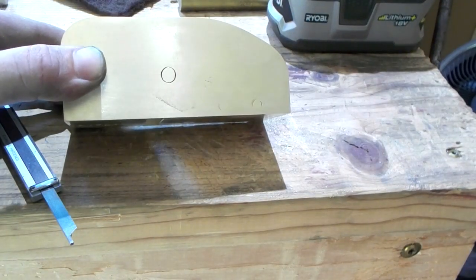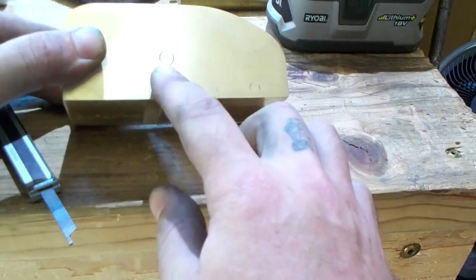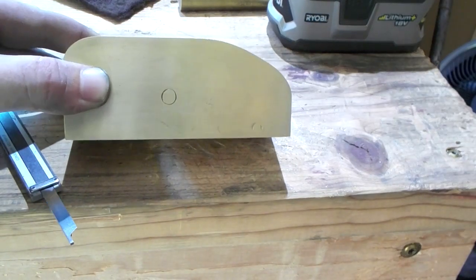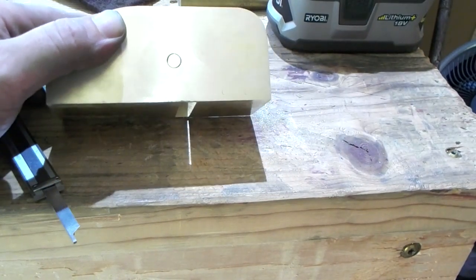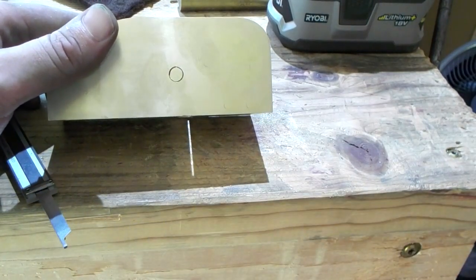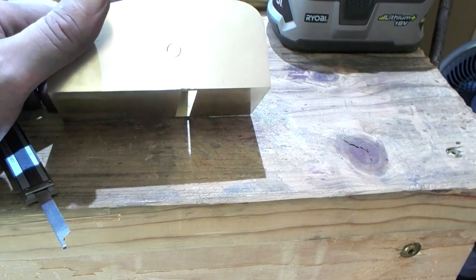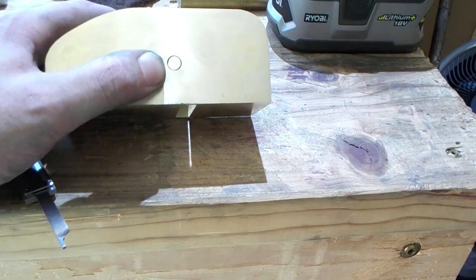All done cleaning up the sides. A couple little peening marks here - like I said the quarter inch I just wasn't able to get it down good enough. I'm still new at peening. What I've done in the past instead of using these pins is drill and tap and then you mill off the head or part of the head - it looks really good, it's just a lot of work to do all that tapping. So I figured I'd try to do the pins. The eighth-inch pins are all right; the quarter inch I've got to find something else to do with that.